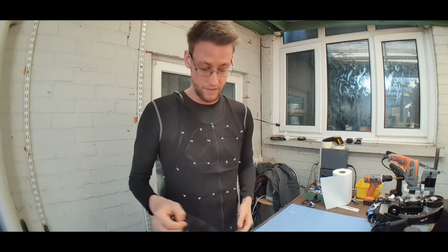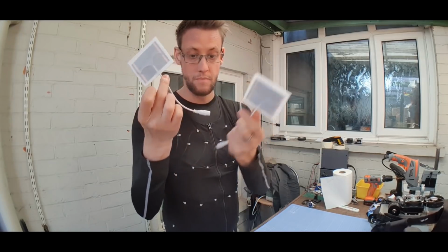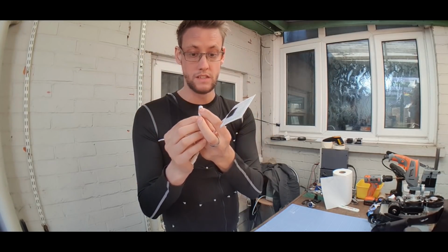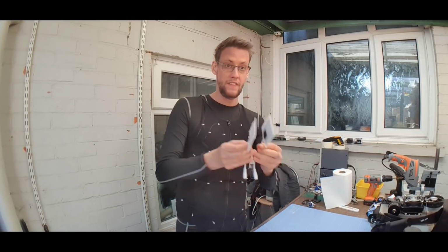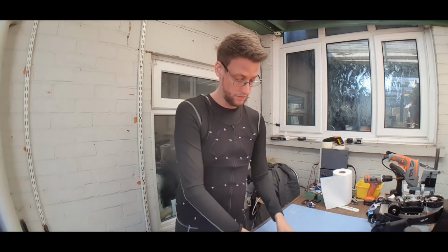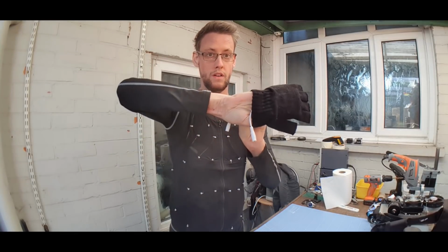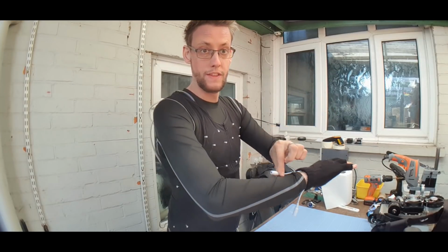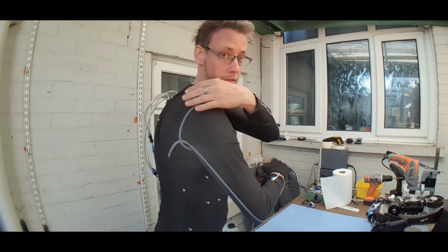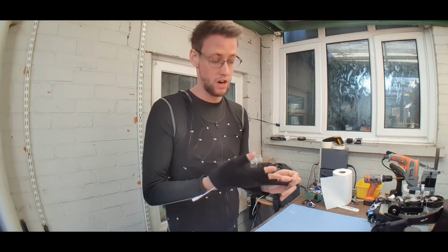We're going to use spandex gloves instead, and inside of each of them are 2 carbon fiber heating pads, simply powered by a simple power plug leading to a USB. Again, takes 5 volts, 1 amp. They'll be in the palm and on the back of the hand in both. So kind of like this, though we won't be using these. You've got 1 at the front, 1 at the back here. Put it on, and the cabling for this would be conduited, as I said, with a seamstress who I've instructed to help me out. That'll be conduited up the back to the center back where it hits the power distribution circuit.